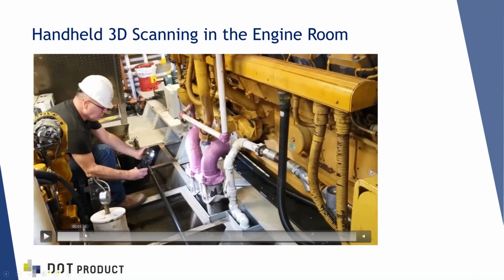Well, let me go back here. There's a scale bar here that we put in the scene, and it's a known distance from one end to the other. We use that as a constraint when we do some post-processing on the data. It's just a check on the dimensional accuracy. We tighten up the data by using these devices, scale bars. And that's what I was carrying in. You could see that in the case in the first slide.